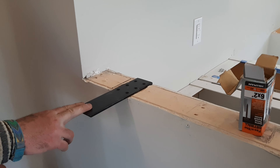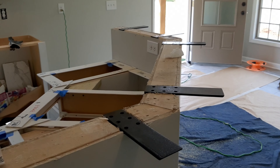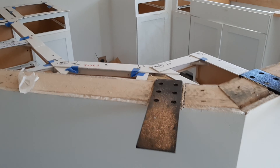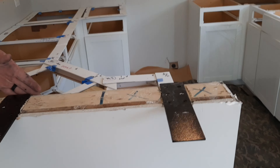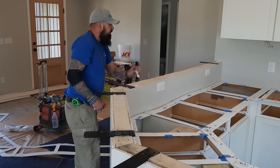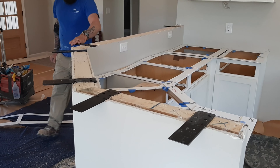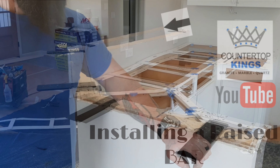If this one ends up being tilted down just a hair, we can loosen up the front screws, put a shim under there, shim it, and then caulk it out. All the front is flush with the drywall so we don't have it sticking over — we don't have to worry about notching that raised bar. It's all nice and flush. And that's how we set up our bar brackets on our knee wall to set a raised bar.